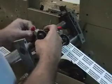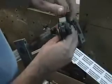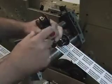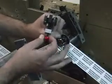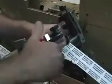Let's have another look at this thing. All right. You can see right there, you just have that spring, and the screw is not going into this part here, you see? It's free to move. So you just have a spring. Now, rule number one, yes, going down on that will squeeze the spring, applying more tension to this, okay? But if you compress it all the way, you start to get that where the coils slip from each other, and obviously you're taxing this too much. So we want to have the minimum amount of downward pressure on that spring. Now I backed it out till I feel that it's free. I'm just going to go in till I present it and just touch that spring. Now that's my starting point for now, okay?